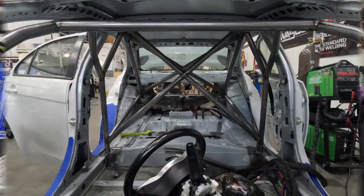So you'll see I have cardboard up in places while I'm doing the MIG welding and stuff to the chassis, so no sparks and slag and different stuff gets all over the place. I use an air hose frequently. I'll try to point that out as well. That's just to keep areas cool, keep flare-ups down, try to keep that seam sealer from actually igniting and really getting on fire. I try to do as many safeguards as possible to really keep everything to a minimum. These are all inherent risks of this stuff. Ask anyone that does this type of work, and they'll tell you it's very tough.